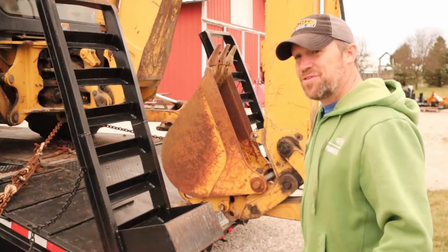I like one-foot buckets for stumping because you don't have the full width of the bucket putting a lot of side leverage on the dipper stick or the backhoe itself. It's just a lot easier to get all your leverage into 12 inches of space than it is across two feet — if that makes sense. So I think this will do a better job of ripping out that great big maple stump. Those stumps are gonna put up a fight, but...